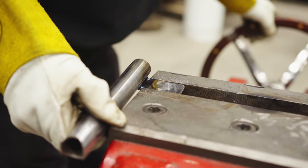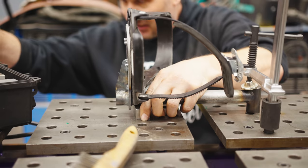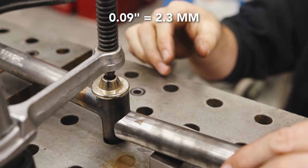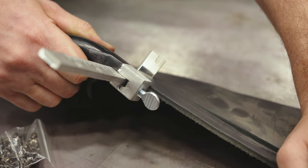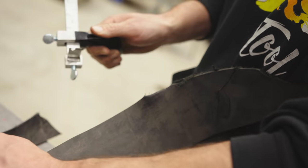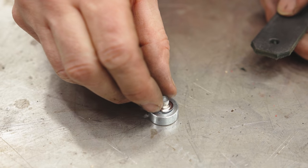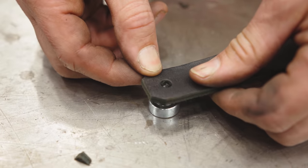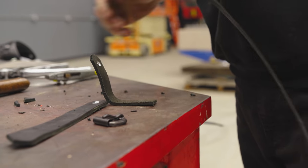I knew I was going to have to add this ankle brace because I could see it in that old video — I left it out on purpose to see how much force was exerted on my ankle, and it turns out there's quite a bit. So this ankle support needs to be pretty rigid. I'm using one inch tubing, 90 thousandths thick, which is probably a little too heavy, but I have it left over from a previous project. Use what you have laying around.